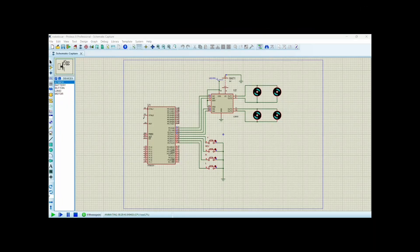This simulation's main components are the 8051 microcontroller, motor driver, battery, motors, and buttons connected through wires. After completing connections and inserting the program file, pressing F rotates all motors clockwise; pressing reverse rotates all anticlockwise; pressing R makes only the upper two motors rotate clockwise while the other two stop; pressing L makes only the upper two rotate anticlockwise while the others stop.